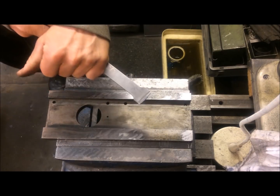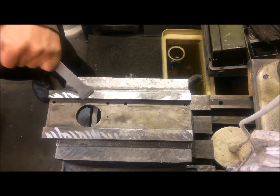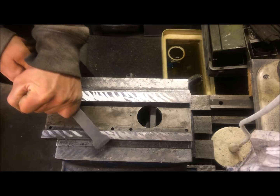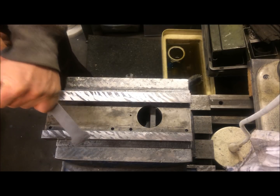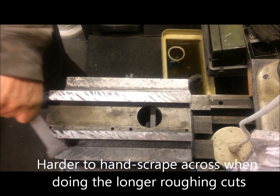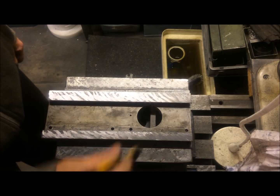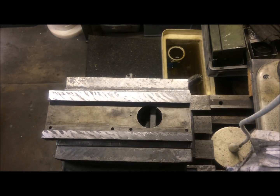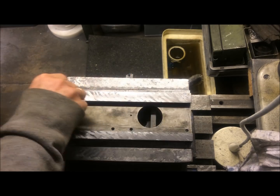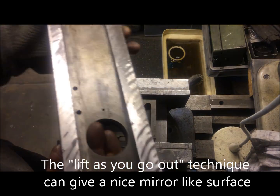Now I will cross it, taking the whole surface. I go lengthwise like this because the surfaces are so narrow anyway. Doing it like this I get almost no burrs if you do the touch and go — or lift, or whatever you call it.